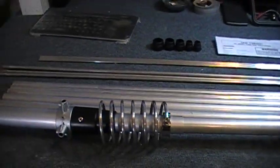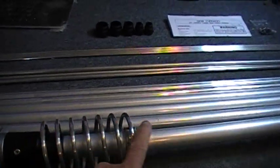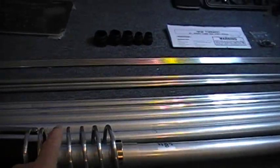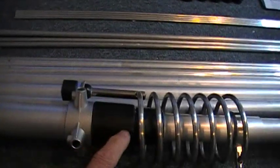That helps with static buildup and whatnot. Now, this isn't. So basically what you have is an antenna where the RF connector hooks right in. It goes to the loading coil and hooks directly to the radiator part of this. So just to be aware of that. And there's a plastic insulator.